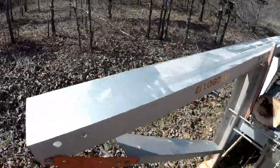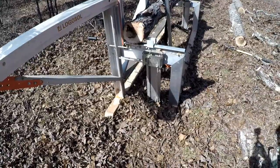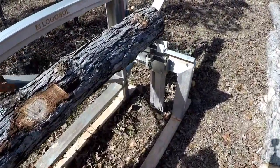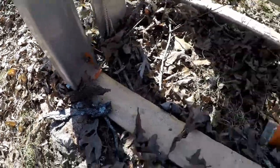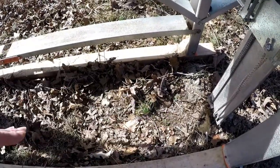What I want to share is something I've come up with that's been really helpful — these, I guess you could call them skis, that I put on the bottom of the mill going lengthwise with the length of the mill, screwing into each of the legs. They have little eyelets at the bottom where you can put a screw. Normally the skis go in the other direction for more stability, but I oriented them lengthwise instead.